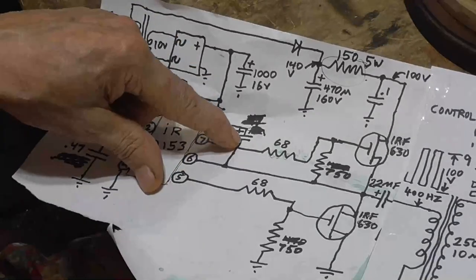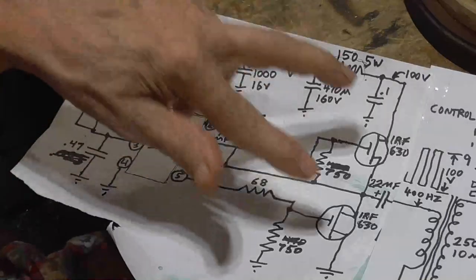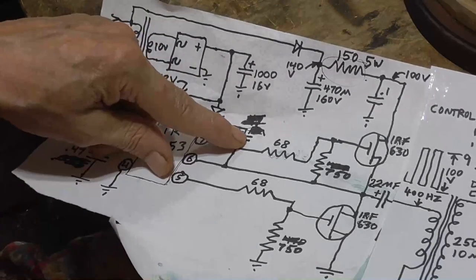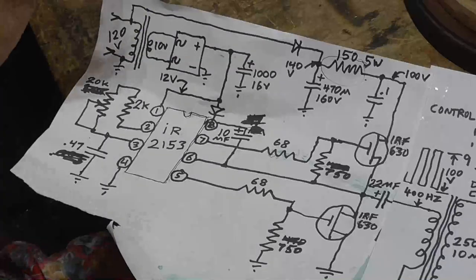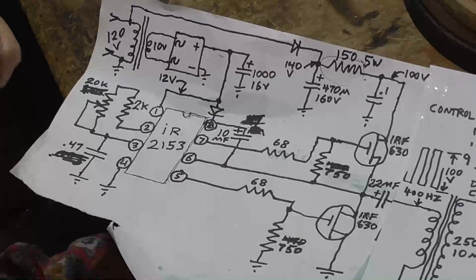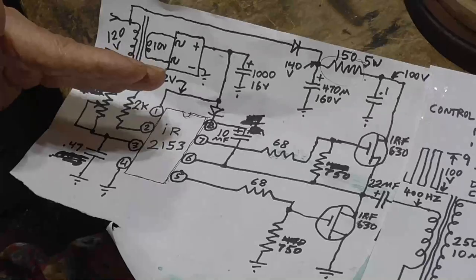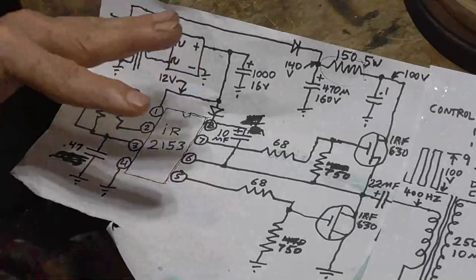Now, this capacitor has to be sized such that at whatever frequency you're operating, it will hold enough charge to charge these gates. And you don't have too much trouble when you're above about 20 kilohertz or even 10 kilohertz. You could use like a 0.1 microfarad in there. But when you start getting lower than 10, a few kilohertz, then you start having that voltage drain off of that capacitor before the gate switch, and that can give you some trouble. So it's better to make this capacitor a little bit larger in size than what you'd normally think. A 10 microfarad will handle down to 100 hertz operating frequency. And I can't imagine wanting to run this thing lower than 100 hertz. You may want to do it at 60 hertz if you're making a 60 hertz inverter, but even that has better solutions than this.